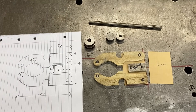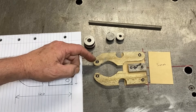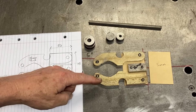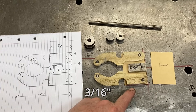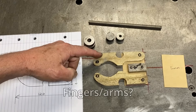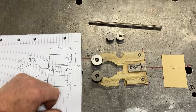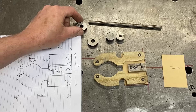It's a little bit hard to figure out how all this is going to work without a plan, so I made a little mock-up here using cardboard and some wood that I cut out on the bandsaw. I can see the sizes and make sure everything's going to work the way it should, and I can just trace these onto the metal and cut them out to the same shape. It's a simple design — there are two five-millimeter flat plates, one on the bottom and one on top, and in between there are two fingers with the knurling rollers on the end.